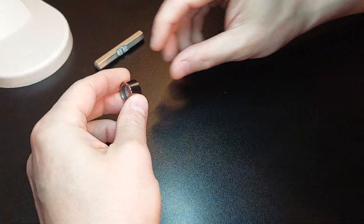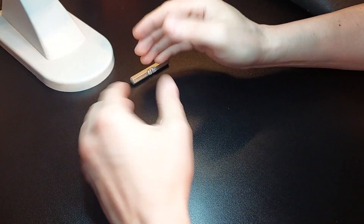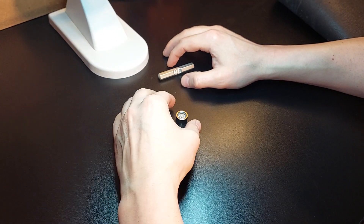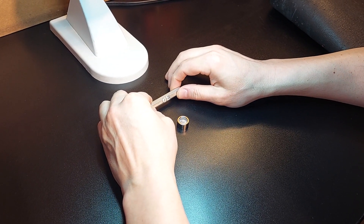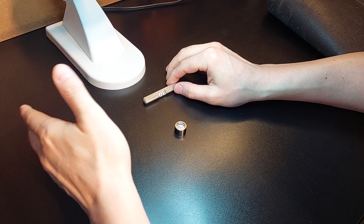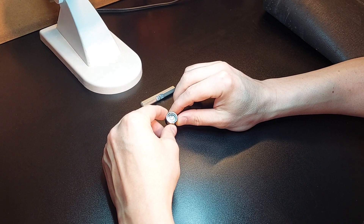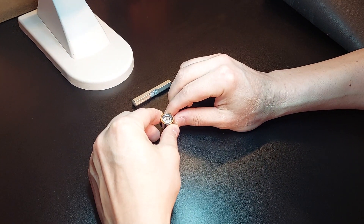It's a very unique level. It does have an actual chrome-plated finish — this is real chrome. You can see how the bottom is; it's perfectly sealed. We use this in many different applications. I have clients requesting them for gun projects where they're trying to level scopes and level Picatinny rails — basically whatever you're trying to do to give something a perfect level assembly, leveling it in two axes simultaneously. This is the type of level I highly recommend when you are setting up your CNC because you are taking simultaneously dual measurements to make sure everything is square with one another.